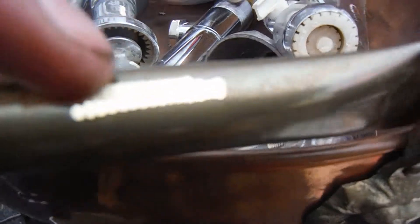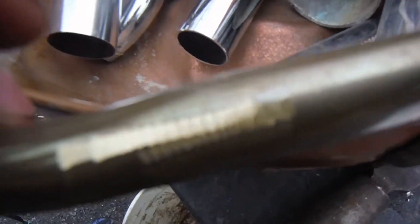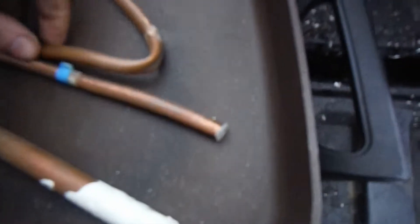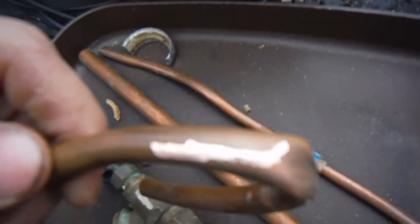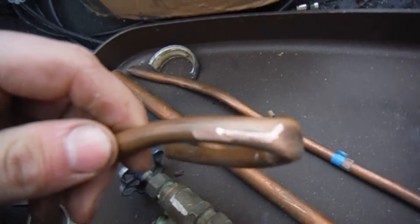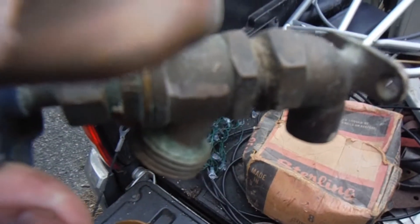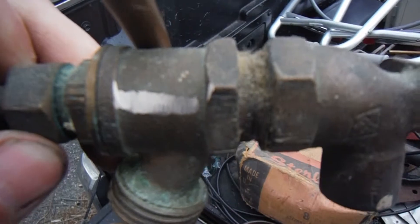Now this is a piece of clean yellow brass. You got this brass pot here — this handle is yellow brass. This piece here is yellow brass, but this is copper. So that's good, but it's got a steel ring in here, so that would be dirty. You got here a piece of copper — that's what copper looks like. And then this piece here is the red brass. Some people can see that red color, others don't. I can't see it, but you can tell by the texture and the application once you get good enough.